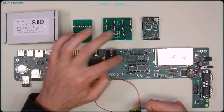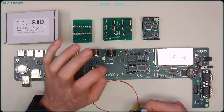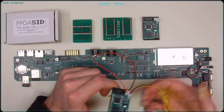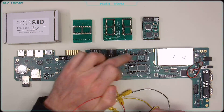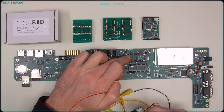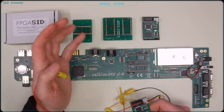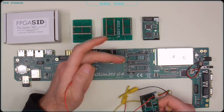You could use the SID tap connector, but that requires an additional adapter. Furthermore, with the FPGA SID as built, it's not possible to feed the signal into the second socket because it's amplified — a different signal level — so it's simply not working.